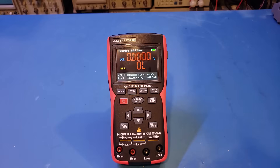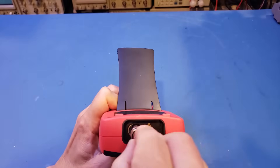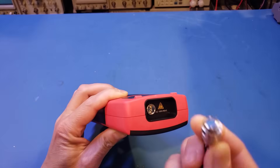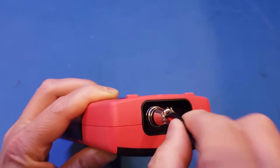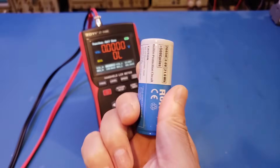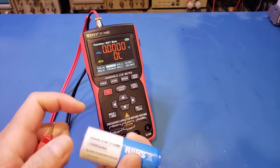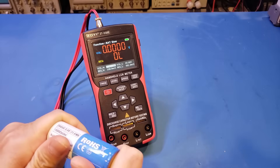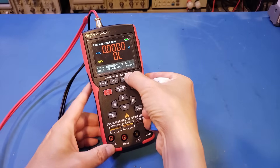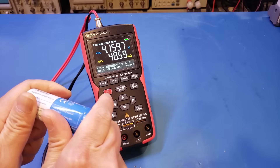Let me hook up the battery tester leads. The connector is keyed and plugs in with a click — you pull the ring to disconnect. Without strain relief, you constantly bend these wires, and I'm afraid over time they'll fail right at the connector end. Now let's look at this battery. We don't have tabs for the Kelvin clips, so the measurement results may be off, but the point is to demonstrate the pass and fail function. You can see that now we're getting a pass. You can also change the display speed — let's set it to medium for faster updates.